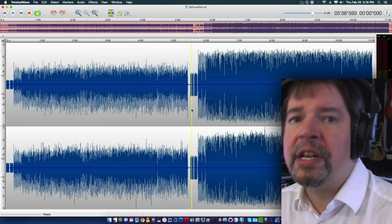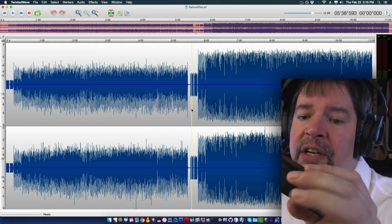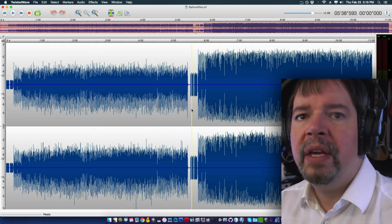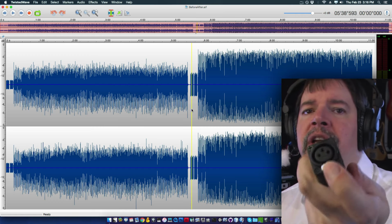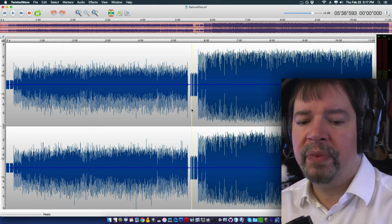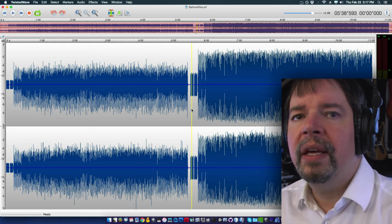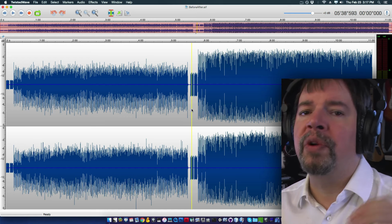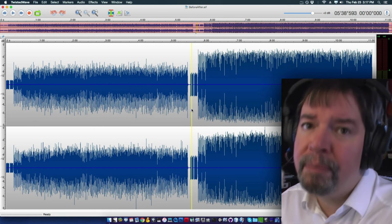The challenges of getting this type of device are usually the enclosure, which is why it would be neat if you can come up with a way of doing it inside a box of this nature, because you can buy these fairly cheaply, just like you can buy cables fairly cheaply. If you have to buy a Hammond aluminum box and real XLR jacks, those get more and more expensive, by which I mean on the order of like $6-8 or something for a really nice one. Something like this, a little plastic guy that connects into something, might be as low as $1 or $2. And buying an XLR cable, it comes with the connectors you want. So you will basically end with a cable with a weird lump in the middle that's covered with electrical tape and maybe tinfoil or something. But you can build these things.